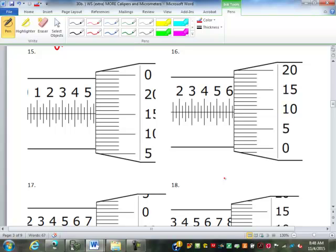That one, would it be like the first one would be 0.015 or 0.001? First one? Yeah. That's 0.550. Right. And then 0.015. Yep. See, that's what throws me off: I keep thinking it's 5 plus 1 plus 1, but actually it's 5, which is actually 10. So the one line would be 25 and then 50. So this is 0.5 here. And then 25, 50, so 0.550. And this is 15. So this is 0.565 inches.